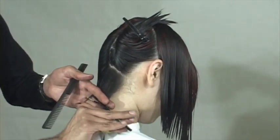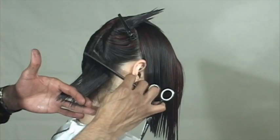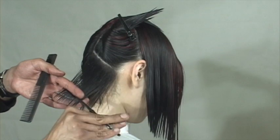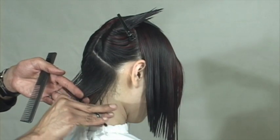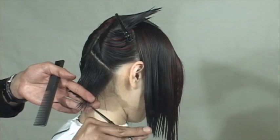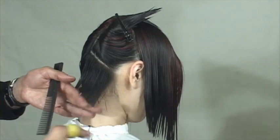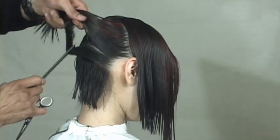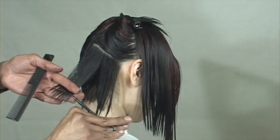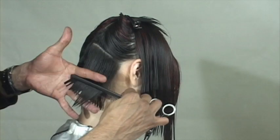To calculate my elevation with math, I have to take the amount of sections and then use the head to determine the highest angle. My highest angle will be 60 degrees and I'll use four sections to reach that. So I can divide 60 by four sections, which gives me 15 degrees. So I know my elevation will have to increase per section by 15 degrees. Anyway, I'll get into that a little bit more.